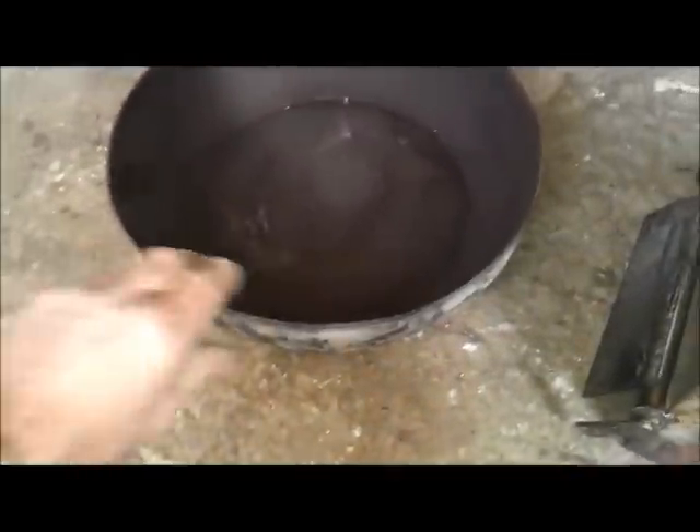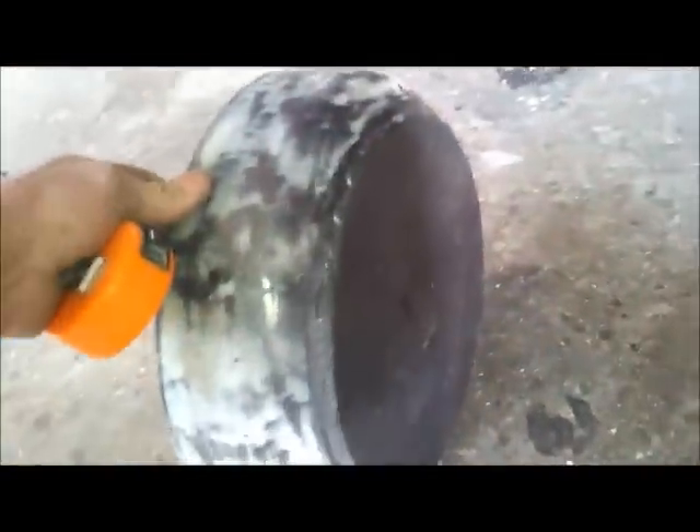That's obviously the lid for the stove - it just takes on and off. What wasn't apparent before is this is just a thin strip of old bandsaw steel that I tacked on all the way around so that the stove can just drop into that. I put a bit of fire seal rope round that and just sat the bottle on it, then wiped it with a bit of sealant, and that was more than good enough.